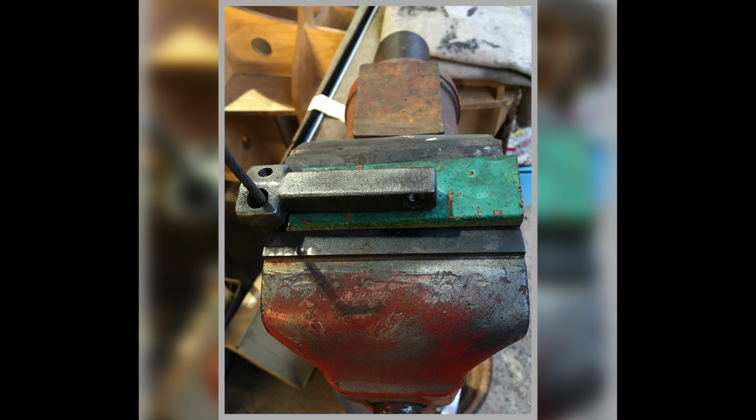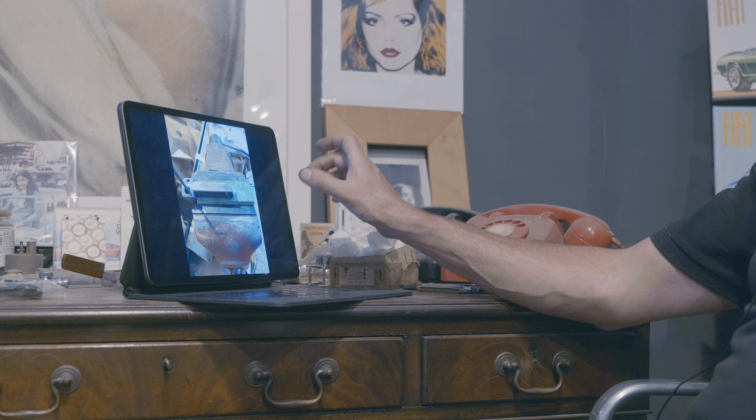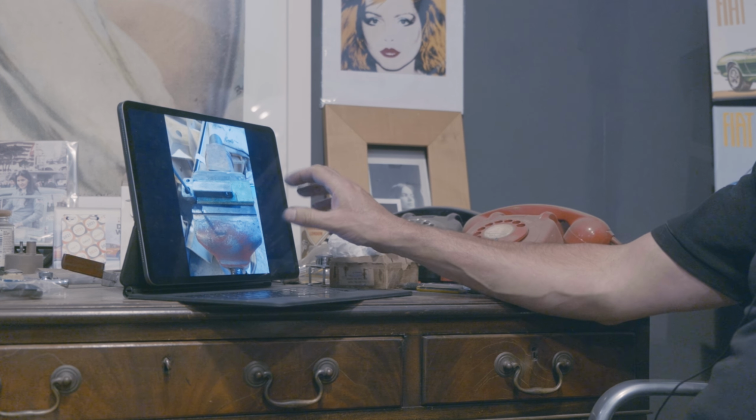And it's at that point that we realised we were missing the quadrant, the actual bit that goes on top of the axle. And we didn't have a handbrake cable. So we had a handbrake lever and the calipers, but the calipers needed some remedial work to get the adjusters right. Then we had to get a handbrake cable made, which isn't too bad. We can send it off to Speedy Cables, get them to do it. The actuator quadrant that sits on top of the differential on the back axle was all missing.